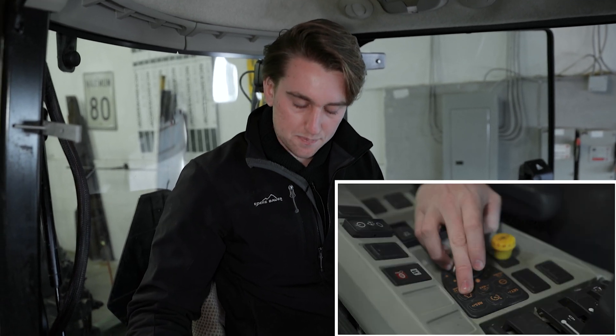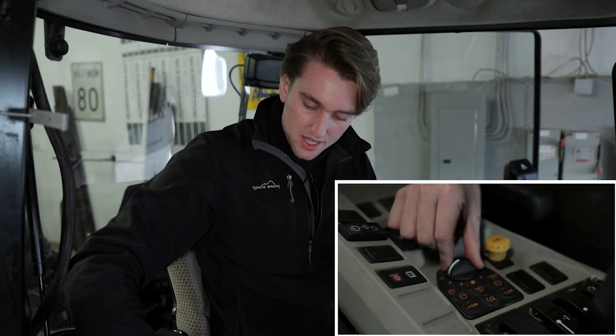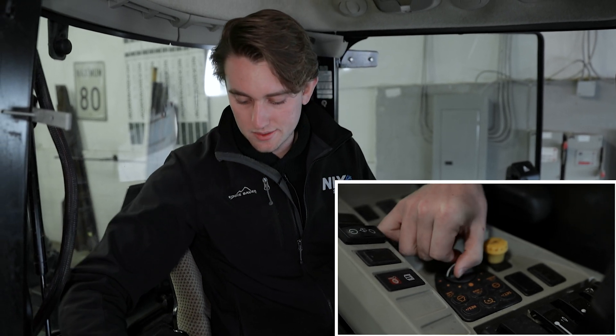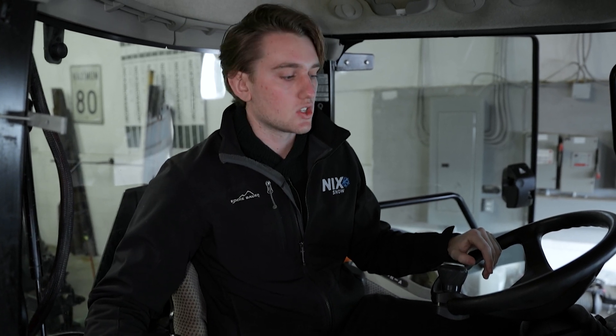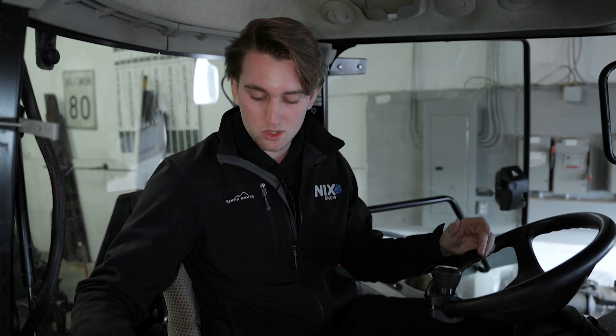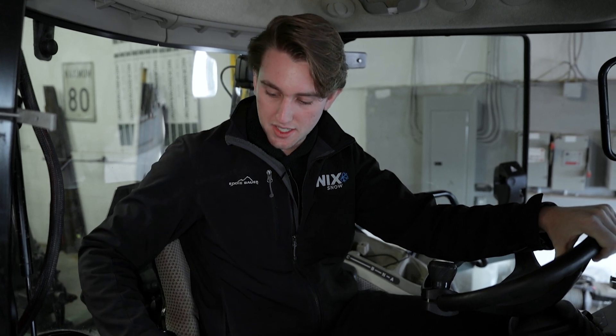This second button just helps it from stalling. You can run it or not. When you run it, it plays with the tractor throttle a little bit and it feels like it's bogging, but it's going to help you out. Some guys run it, some guys don't — really a preference. This dial is your rollout speed. The looser you make this, when you let off the pedal, the slower it's going to be to stop. When you tighten this all the way, it's going to be super snappy. I like to run it quite tight — one or two, or all the way even. When you're going constantly forward to reverse, it's nice because in front of a garage door you want to be one pedal to the next all the time.